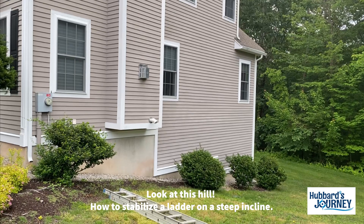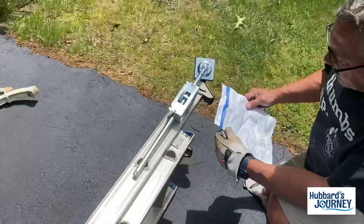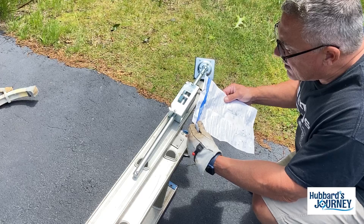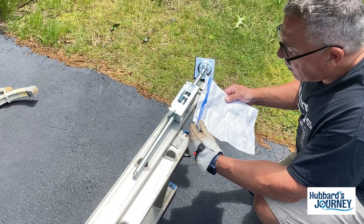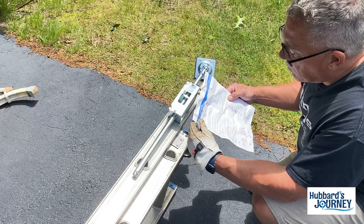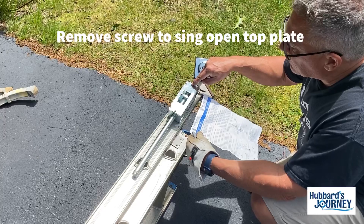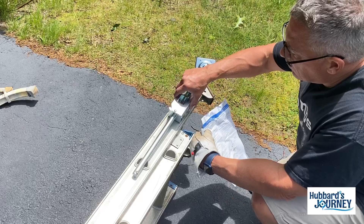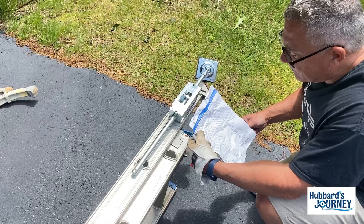It's 14 inches in adjustment — I thought the one I bought was 21 inches, but we'll have to take a look at that. This leveler gives you the ability to adjust the height on an incline and start the process. This Dynamite Ladder Pro is not recommended for use on fiberglass extension ladders. Required tools: two 7/16th inch wrenches or socket and a quarter inch drill bit. Remove the existing feet to the ladder if applicable or desired. Remove screw one from guard and swing up to expose the mounting holes. So it wants me to remove this guard, swing it up, mark the holes, then drill the holes — quarter inch. This is the position it's going to be in. You want to align the center of the leveler with the width of the rung, based on the diagram.